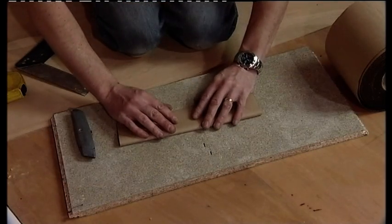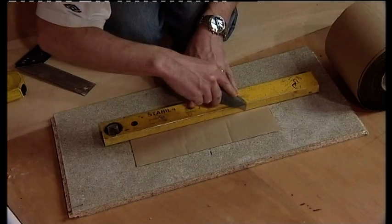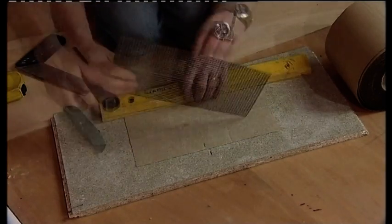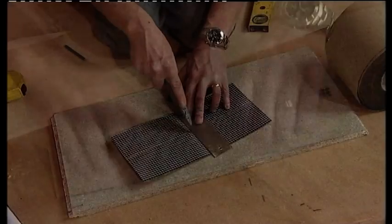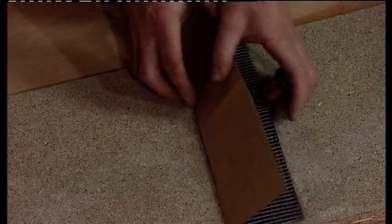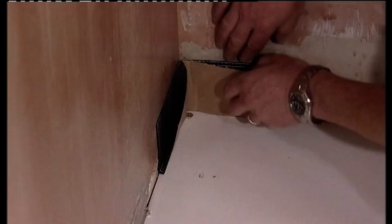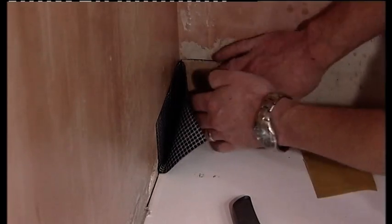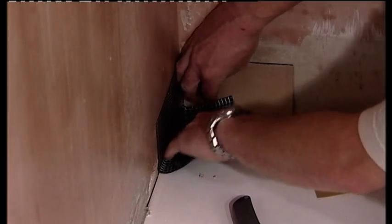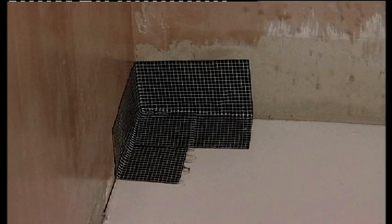Firstly, the corners need to be dressed. Carefully cut a strip of joint tape to about 300 millimeters and fold in half to form a seam. The backing paper must then be cut carefully, ensuring not to cut into the reinforcing tape. Fold in half halfway through its width, then fold twice ensuring the edges are even, and peel the backing paper. Then place in the corner of the room, pressing firmly until it is bonded to the wall. Then peel the paper from the first front section and press firmly onto the floor. The protection film is then removed and this operation repeated on the remaining piece, which once completed creates a sound overlap joint.